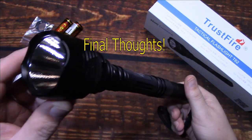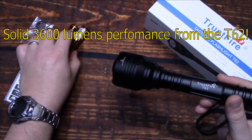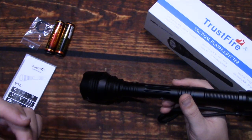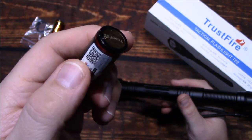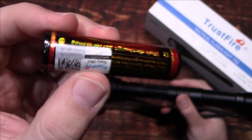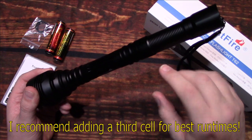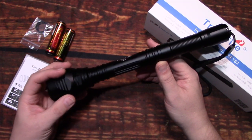Welcome back — hope you enjoyed those night shots. Really solid performance on this light. I like the fact that you can run it on two batteries, and included in the kit are two 18650s — really nice, powerful cells. I've had Trustfire cells in my collection over the years and they've always been quality cells. Now there are a lot of fakes on the market, so make sure you get the ones that have the scratch area where you can validate the battery, as well as the protection plate on the bottom — make sure that has it, if it doesn't, most likely it is a fake cell. Getting back to the light — very nice performance, a lot of throw. Adding that extra battery I think is very much needed, especially for this LED which draws a lot of power. If you want the best run times, using that third cell is going to improve that. It doesn't really affect the light output, it's just the run times that are increased.